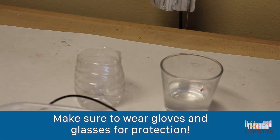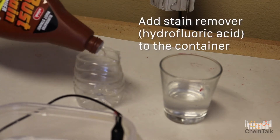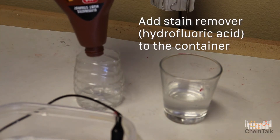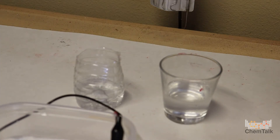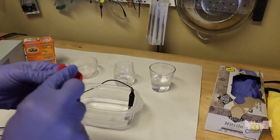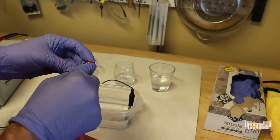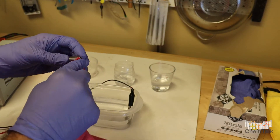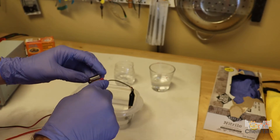I've got my gloves on — make sure you put gloves on for this. You don't want to hurt yourself with any of this hydrofluoric acid. Make sure you also wear glasses. Right now we're adding hydrofluoric acid — specifically a rust stain remover. Don't use pure hydrofluoric acid; that's completely unnecessary. All that's for is etching the part to make sure there's a good surface for the anodization to stick to. Also under the cup to the right, we just have distilled water. Right now I'm going to dip this into some acetone and wipe off all the oil or sandpaper residue. This is the most important step outside of surface finishing — if it ain't clean, it'll show up in your final product.